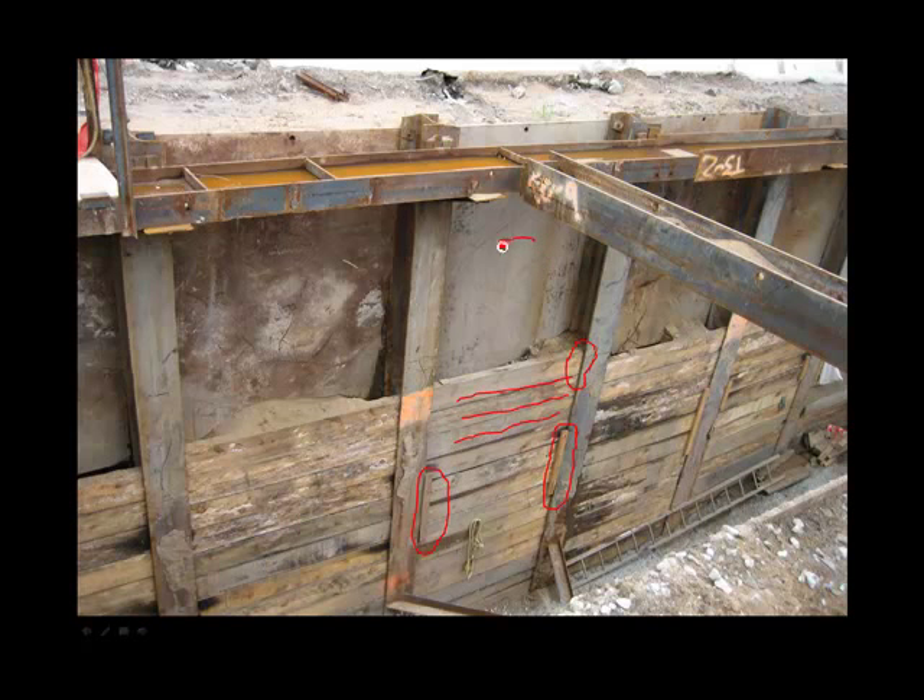Here you can see how a steel roadway plate has been used in place of the horizontal timbers. So the initial excavation can be lagged using this steel plate. It's accomplished very quickly — the plate is dropped behind the soldier piles and you can get the first four or five feet of excavation lagged very quickly. Of course, that space has to be free of utilities.